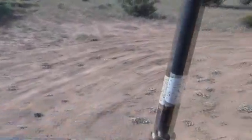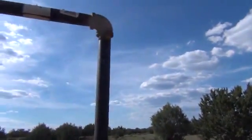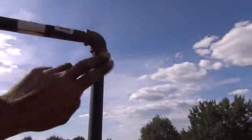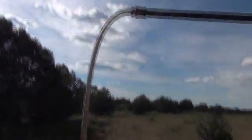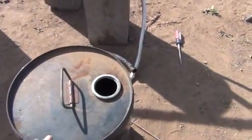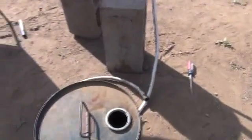As this gas starts to cool, it's going to come up here and work its way uphill. The hydrogen inside of the gas will be the lightest of all the gases traveling uphill and will definitely make it over the top. Much of the creosote will drip back down into the second collection container here. The rest of it's going to go up, cross through the pipe, come down through this, and right now what I'm doing with this can is setting it up to become a condenser. I'm going to fill it with cold water — that's going to make a coil inside of it and come out the bottom.